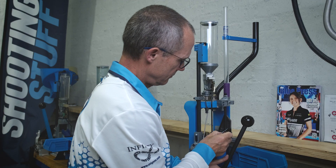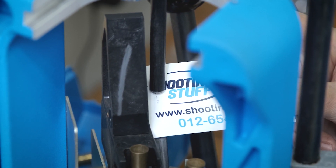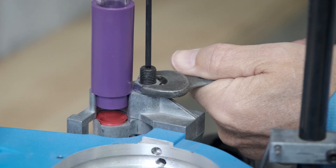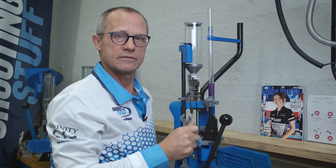When the camming pin is correctly adjusted, with a primed case in station two, you can get something like a business card to just slip in there nicely. Snug it up to lock it in place. No more movement. We're sorted.